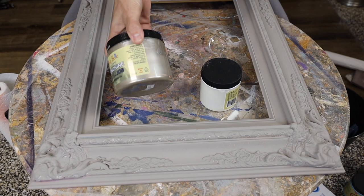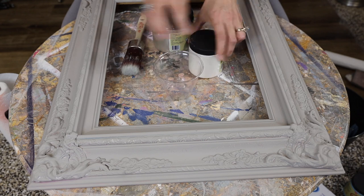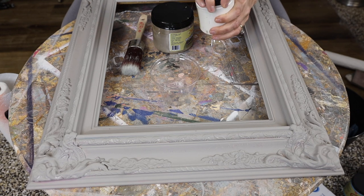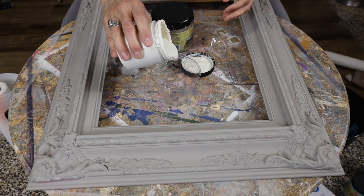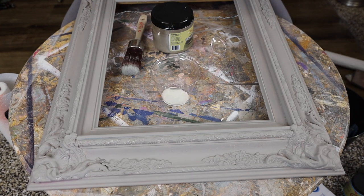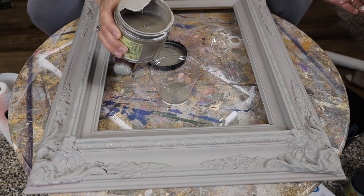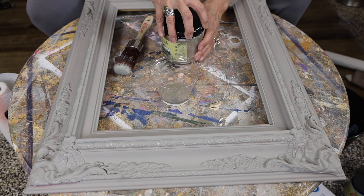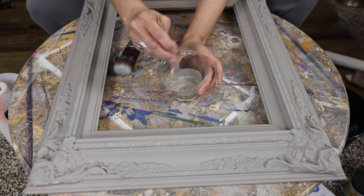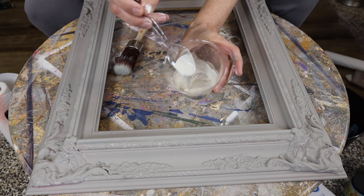It's been 24 hours and I'm going to be mixing a metallic called Moonshine Metallic. I decided to mix it with just a little bit of buttercream, which is like an off creamy white. I'm going to mix the two together and kind of treat it like a glaze. I'm putting just a dollop of my buttercream — you can use any light colored, off-white color because I'm going to be mixing it with the metallic. I'm doing a little bit more metallic than paint because I don't want to reduce the sheen. I want a little bit of metallic sheen. It's going to act like a glaze because the metallics are so smooth and they're not chalk based, and it's going to add just a little bit of sheen.